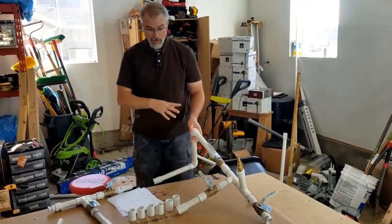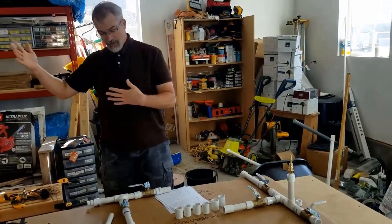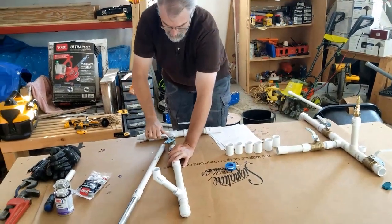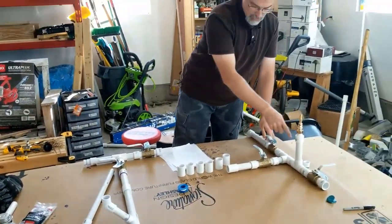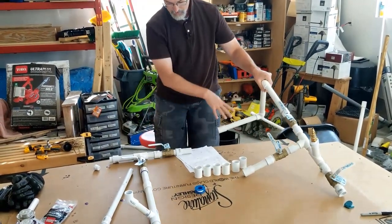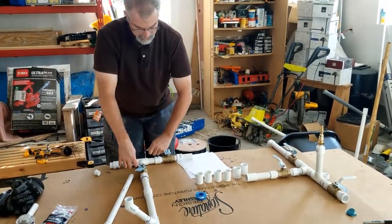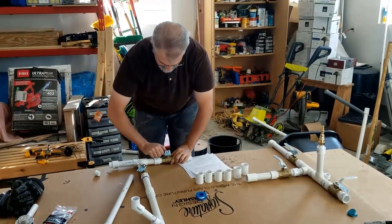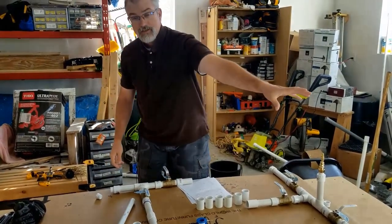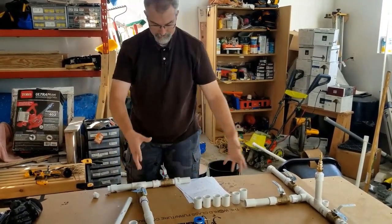But I just need to get, this is my water line to get over to my other sprinklers. At the point when I make the corner on my yard, so I'm going straight and I make a corner, I have another valve. Because what I'm going to do is cut that off and blow this line out, and I have a little plug here. So this will just be water going all the way down here. It's just part of the line. It'll blow everything out from here. Then I can close this off, open this up when I want to winterize it, and then I can come to the other side where my sprinkler is going to be at some point and blow it out this way and blow all that out. So that's my plan.